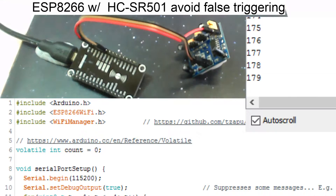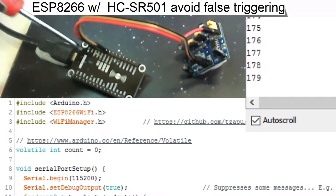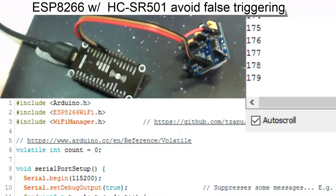The other part of the problem I've discovered is that when the Wi-Fi chip is running, it's drawing power whenever it does anything. Essentially what you need to do to get this working consistently without false triggering is disable the Wi-Fi when you're not using it. I know that's not going to work for some applications, especially where you've got a WebSocket type setup. If you don't do that, then you're going to have to power this device separately.